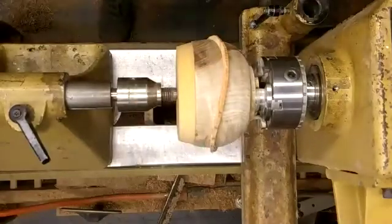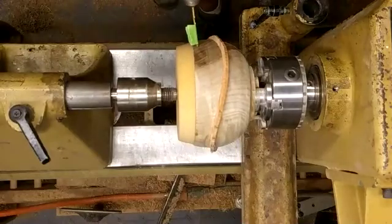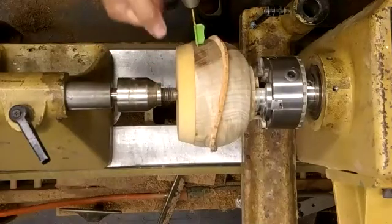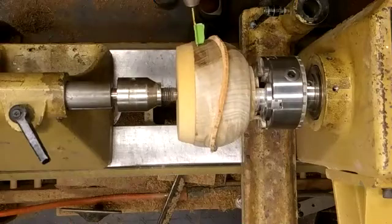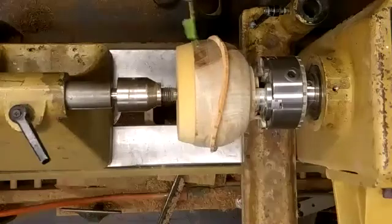So I'm going to drill these over to the side so you can see me drill them. Reason I use the hand drill here: a power drill has got enough torque where the tape can slip. If you don't stop it easily, the tape can mash up in here. So you just have a little more control over it, a little more finesse with the hand drill. Turn right up to that point.